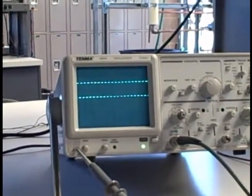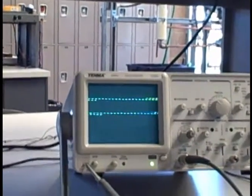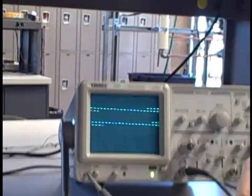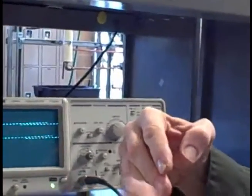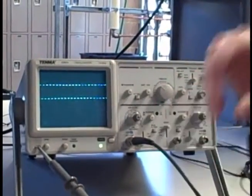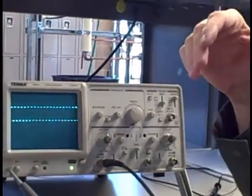If you ever used a timing light on a car, for example, to time a car's ignition, it's a special xenon bulb that hooks up to one of these spark plug wires, and as you point the xenon bulb at the rotating vibration dampener, they've got a readout that shows you the timing of the engine, how far before or after top dead center the number 1 cylinder is firing. This strobe light flashes once every firing cycle of number 1 cylinder, and so what happens is you get this, it's like a strobe light effect.